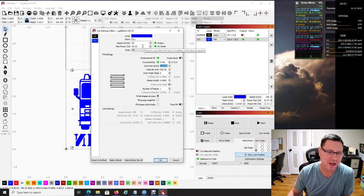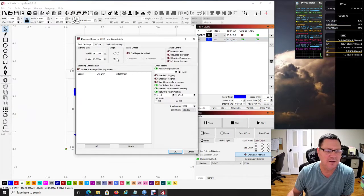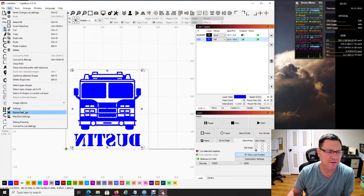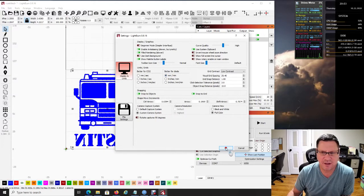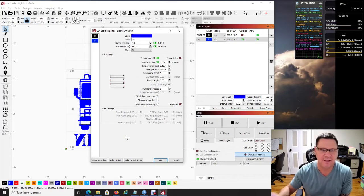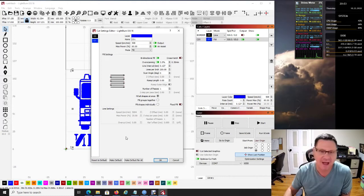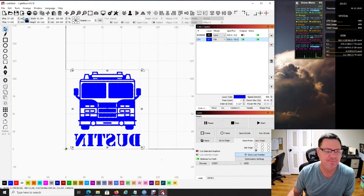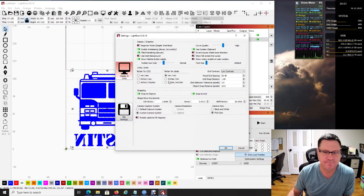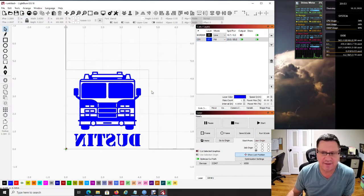Don't forget, I'm in inches a minute. I'm not in millimeters a minute. If you click OK and then you go up to edit settings and change it to millimeters a minute, click OK, double click. So you can see now, I'll leave it up for a second. You can see my settings, speed 508, still power 85, and the lines per inch. I don't need the air assist on, not that it really matters, but anyway, I'm gonna change that back to inches. So basically, that's what we got, that's the size, and as far as I'm concerned, I'm pretty much ready